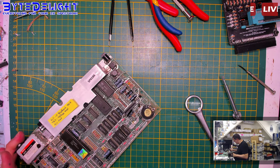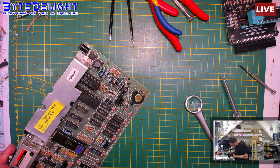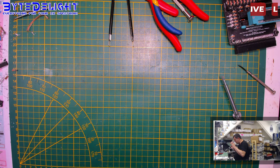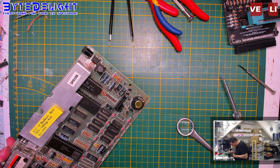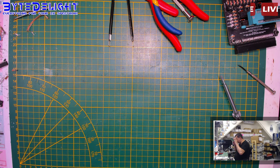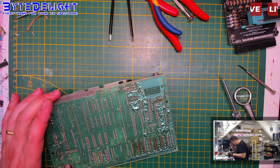For example, when one of the tapes is not being pushed down outside of the machine, which can cause the head to crash, and that's really awful when it happens, and takes a lot of time. When the head of the pick and place machine crashes, you have to recalibrate the nozzles and the pick-up and other stuff. That's really frustrating when that happens.